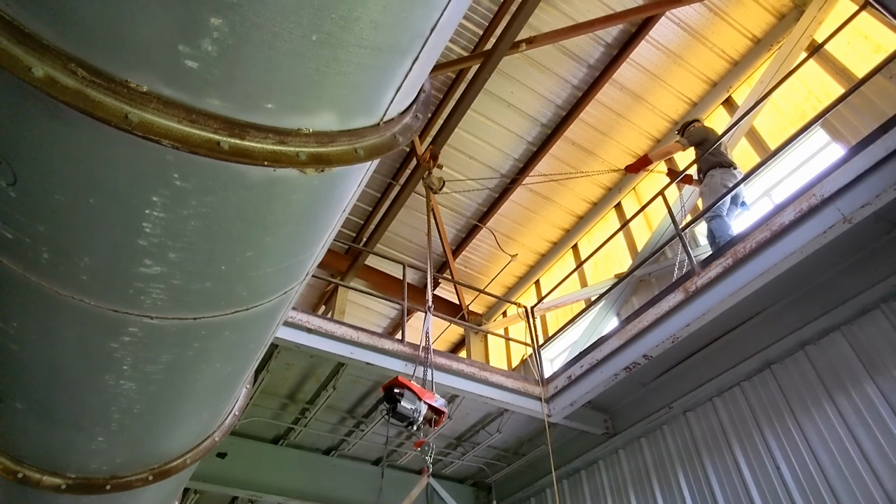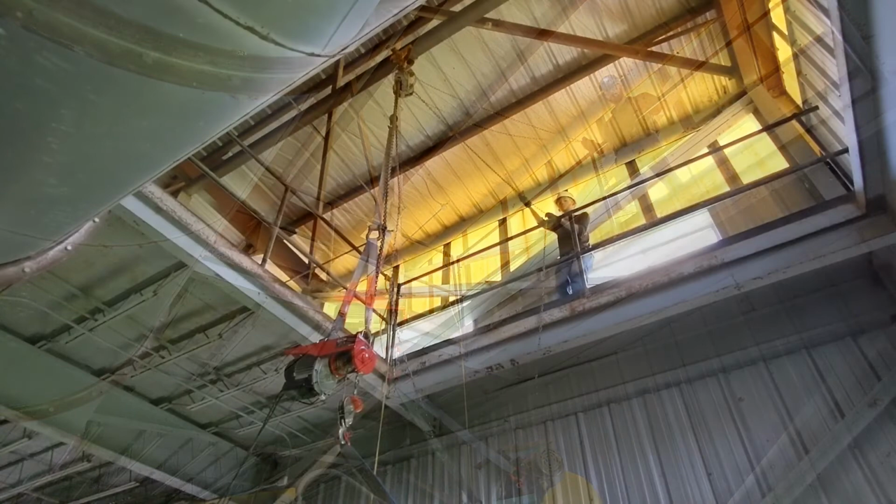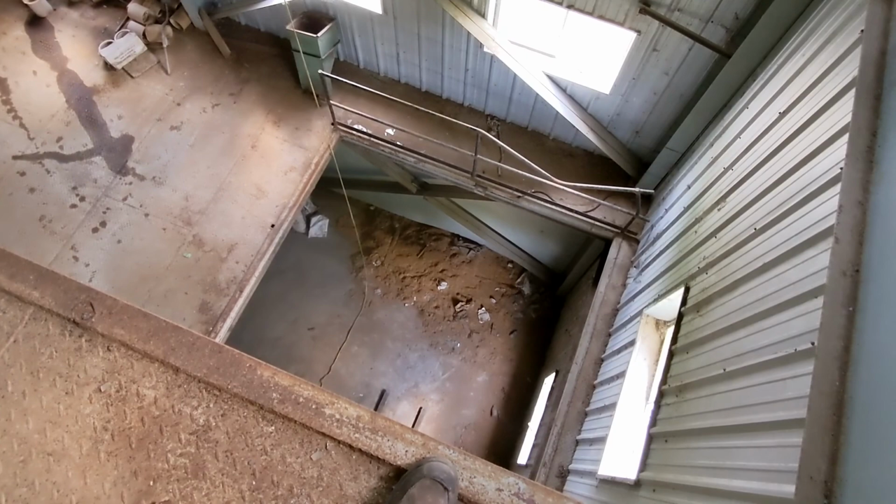Luke then drags out the beam trolley right out to the middle of the hole. And now we're ready to lower it down. Judah is going to lower the chain hoist to its maximum length. Then we're going to go down a floor and lower the cable hoist. And then we should hit the concrete floor.